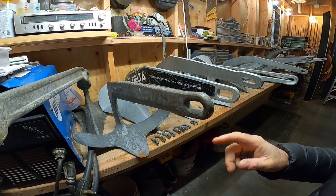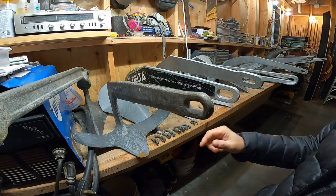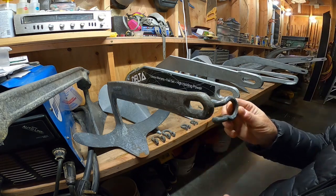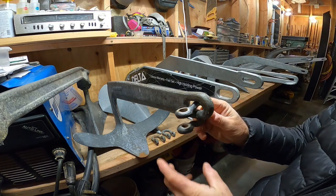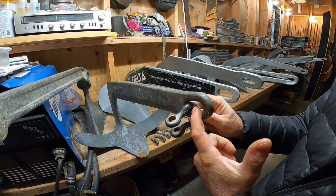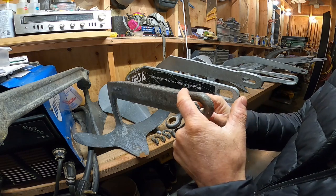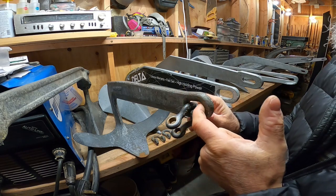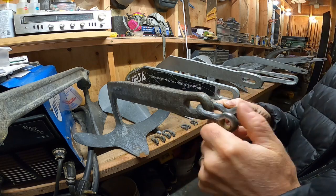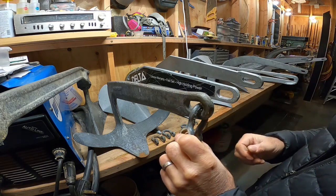Here's a 44-pound genuine Bruce anchor. We notice that the hole is slot-shaped, and that allows us to pass the boss of a 7/16th shackle through no problem. Notice that the edges of this are rounded wonderfully, and it's so nice that even on this old second-hand anchor, the galvanizing is still intact where it turns the corner here. I wish all slots could be this nice to use.